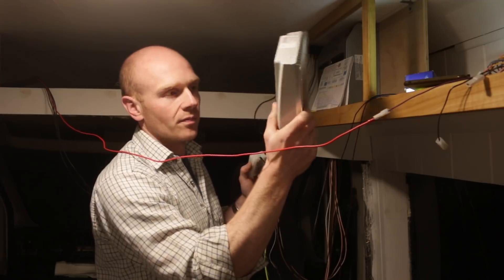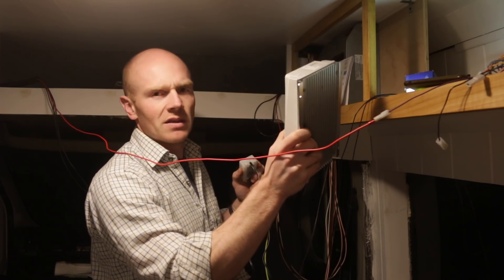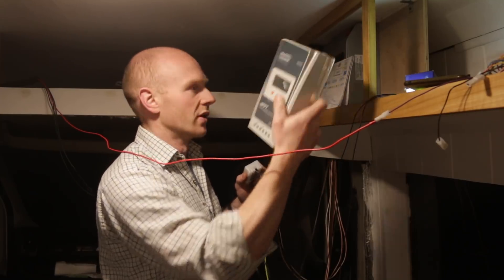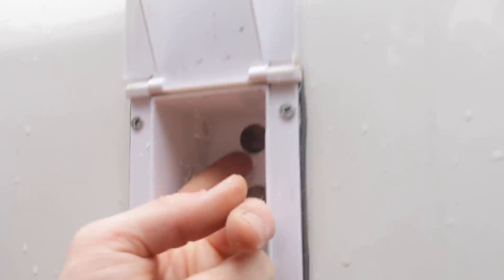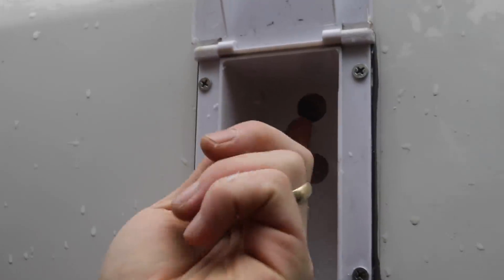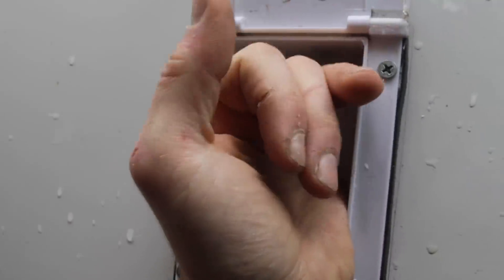We've also got our solar charge controller arrived — a beauty off Amazon. We've got a 200 watt panel and this is a 20 amp MPPT charger, the Epever — Photonic Universe brand is who we ordered it from, but pretty sure they're all the same. Major fail: as I was trying to fit the system and I was pulling up the electric hookup, I pulled it out of the socket and I hadn't connected the plug yet. It usually comes through the top through a grommet and I left it just loose in here — like 100 mil of it — and I pulled it up. Fortunately I can see the wire so I just drilled another hole below and I'm hoping I can push it up, grab it with some pliers, pull it all through — got keyhole surgery going on here.